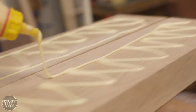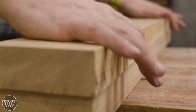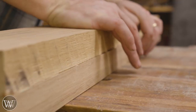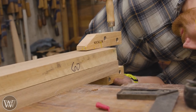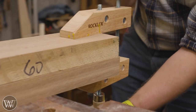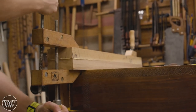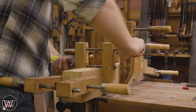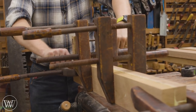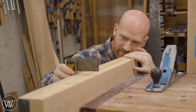I'll put glue on both sides and put a copious amount on there, smear them together, making sure that I get glue on all surfaces and allow the glue to squeeze out on the edge - that way I know I have a good amount of glue sticking all the way around. I'm going to be using a lot of screw clamps; several of them are all wooden screw and some of them are steel screw. I have a fairly large collection of them, although I could always use more - I think I used all of them when I did all four legs. They're a lot of fun to use though, especially the wooden screws - you'd be amazed at how much pressure you can put on those.